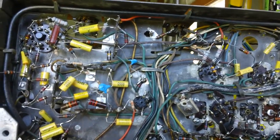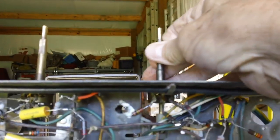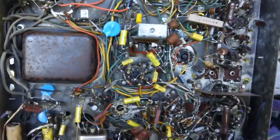I'll have to take out every tube, clean the sockets on every one, spray them out really good, and put them back. These pots will have to be sprayed out and have a little WD-40 put in them to loosen them up. We worked on this thing for a long time — 27 videos, boy that was fun. Now I'm going to take the spray can and apply some QD electronic cleaner down inside there and work these knobs back and forth on all the pots on the front. The chassis is upside down and the holes are accessible, so I'll give them a blowout too.